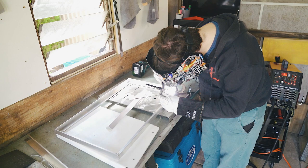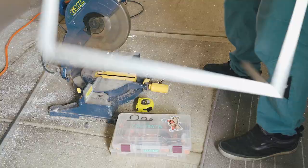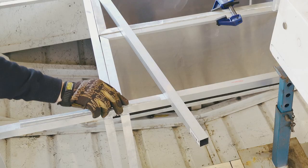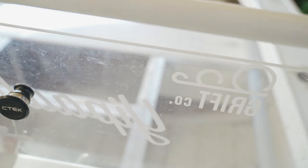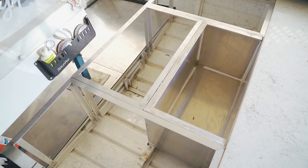I'm so glad I've bought myself a TIG welder, as I think it's so much more forgiving than a misdrilled hull and poorly set rivet. With a correctly sized frame squeezed tightly between the outer frames and into position, it was possible to secure the uprights into the floor trusses temporarily. My logic is that if I'm likely to remove the frame modules, it's possible to over-torque and strip the self-tapped threads in the soft aluminium — rivnuts would provide a more permanent solution, but that's for later in the video. After clearing the tools, it may be more obvious how and why the livewell tank is a structural component to the deck.